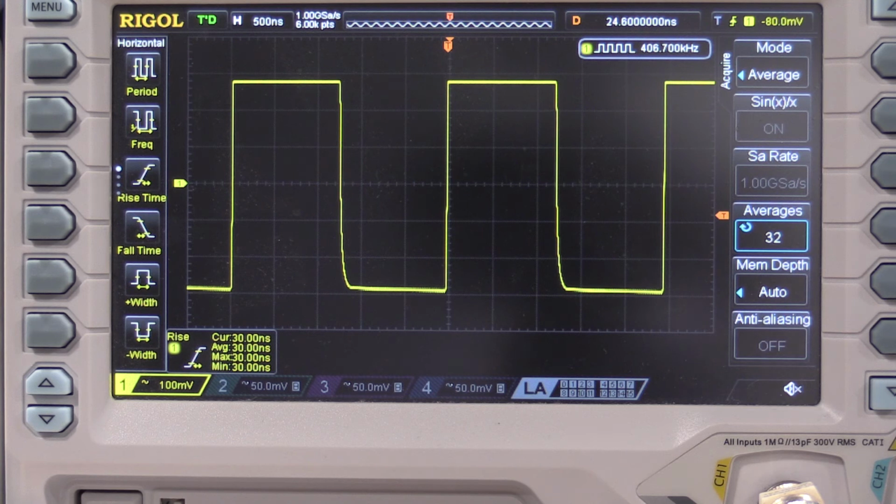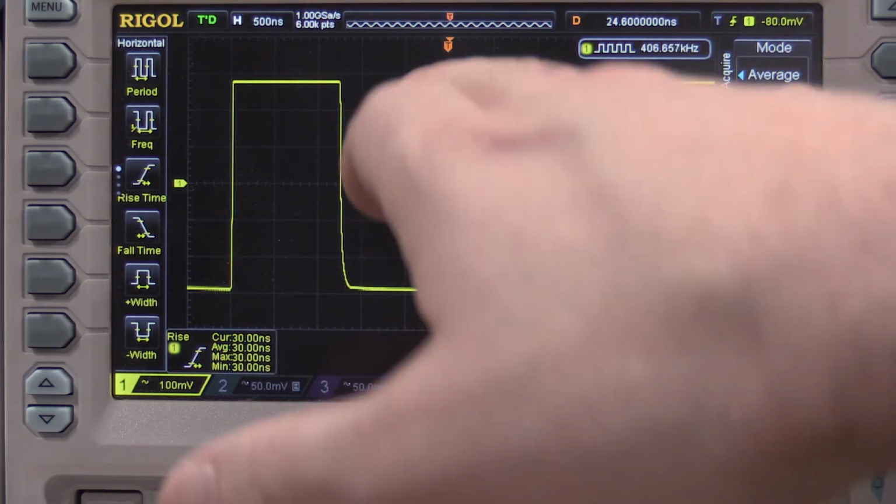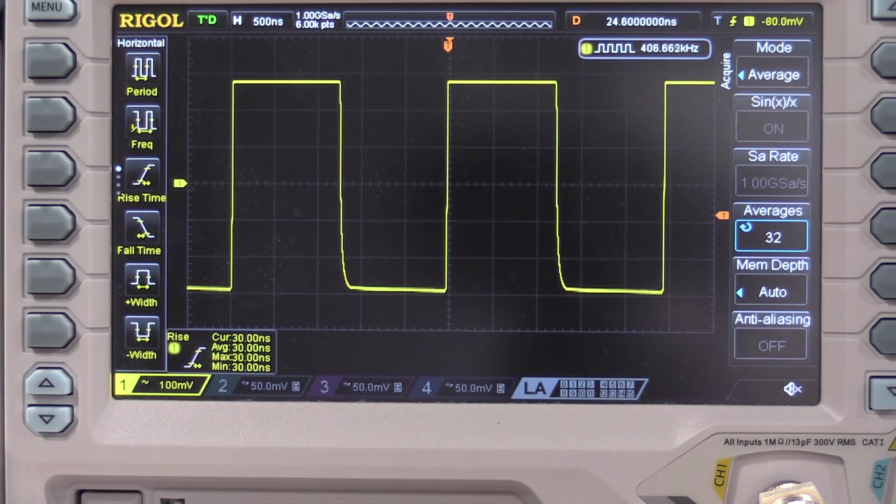This is not something a function generator can do. This is not something a signal source can do. I have a Tek 284, which is a pulser. It's 70 picoseconds on this rise time. It doesn't work at the moment. The diode's good, but the resistors in the delay line have drifted up out of value and the diode's not firing. That's the problem with it.